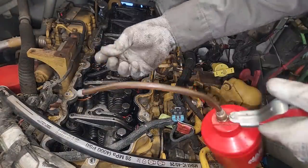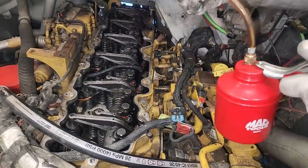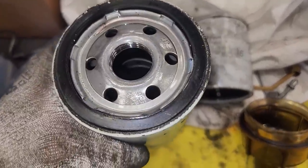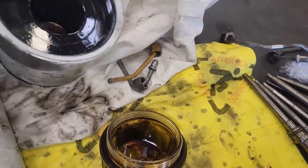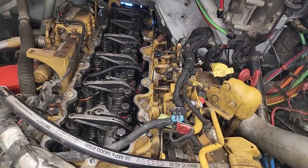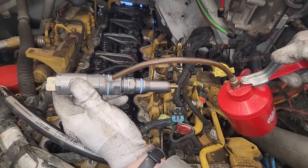What we're going to be doing here is lubricating the top of the injector bores. The reason you want to do this is because the injectors have O-rings, and O-rings against bare metal can catch, damage themselves, or cut. A question I got a lot: why did the injectors go bad in the first place? No one knows for sure, but I'm going to bet poor maintenance. These filters — which aren't CAT — are so old the part numbers are basically weathered off. The customer didn't even know it had a fuel-water separator, and the fuel-water separator element on the inside is pretty nasty — you could see sediment and dirt on it. Yes folks, you need to replace your fuel filters. So we're going to lubricate those bores with clean engine oil and then lubricate the injector O-rings themselves to help them slide in. Perkins for some reason tells you not to lubricate them, but I'm not a big fan of Perkins, so don't listen to them.